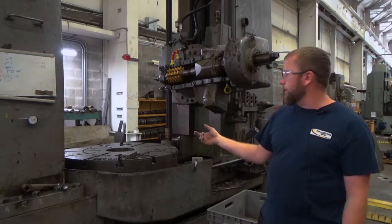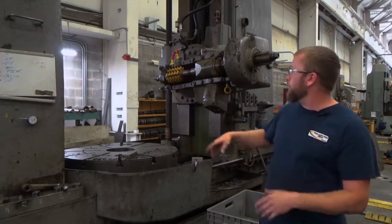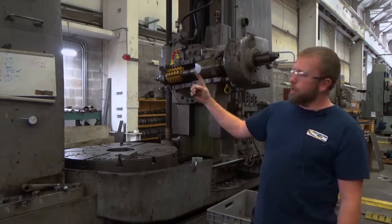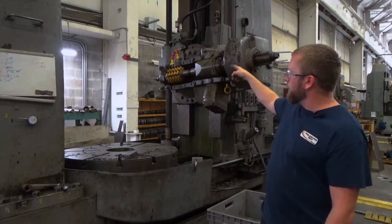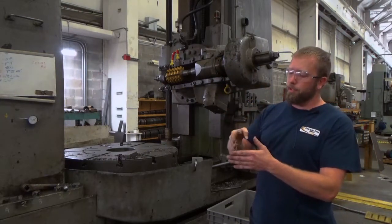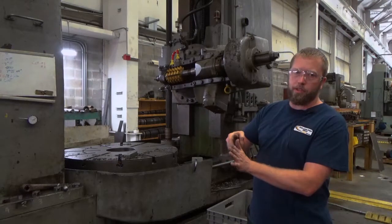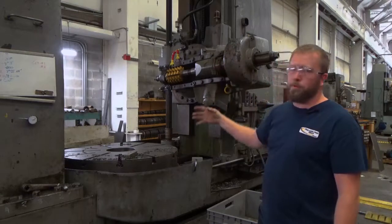It has constant indexing, so as the gear is coming around, it's always generating the same number of teeth. Your part is rotating — as in a lathe stood up on its side, or as in a vertical lathe — and your hob is spinning forward on an angle. As it's coming down, the hob is intersecting the gear teeth as it's traveling in a circle, and as it comes down, the angle creates the hob angle and it generates the part.